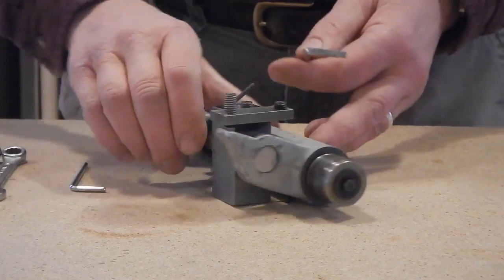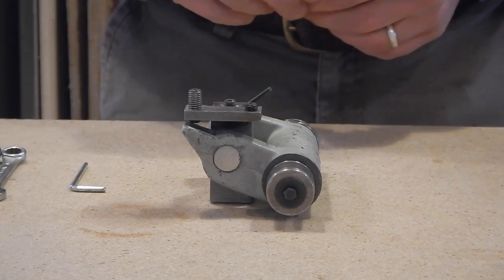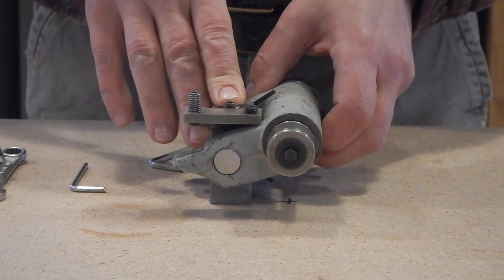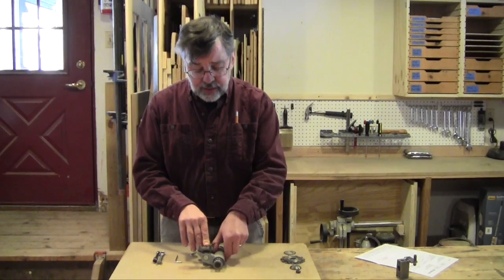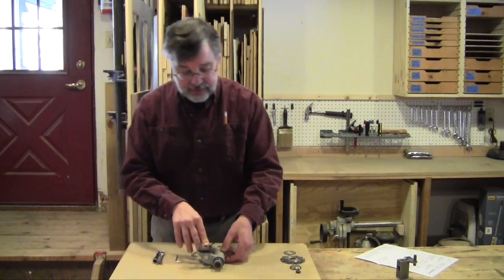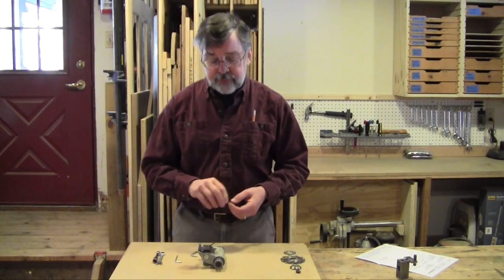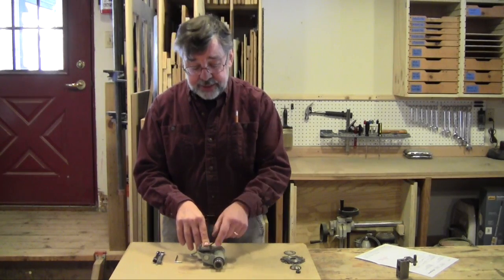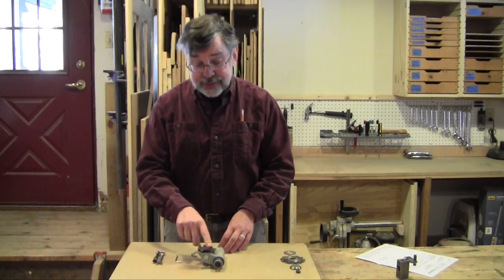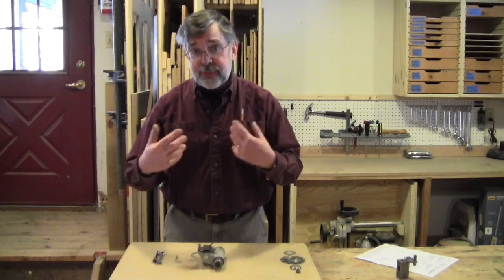The second item is this set screw here, which I don't believe we've touched on before. This is the set screw that raises and lowers the blade, and its only conceivable purpose is to limit how high the scoring blade can be raised. One of my little pet peeves with the CU-300 is that the blade raised to its highest level would only barely clear the surface of the table. So I'm going to back that off so it's barely protruding and see how that goes. This is not accessible through the tabletop, so after it's installed that would be difficult or impossible to readjust without taking it out again.